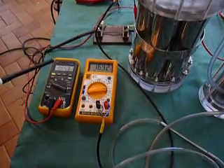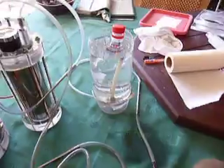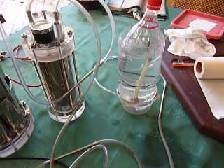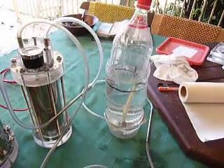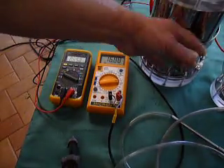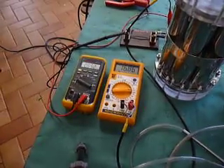Okay, back to where we've got there — 65.3 amps and 16.9 volts across the cell. See what sort of flow we get — close the cap and start the time. One, two, three. Fifteen seconds, I reckon — so that's about four liters a minute. It's only slightly warmer than the ambient temperature today, which by the way is about 23 degrees.